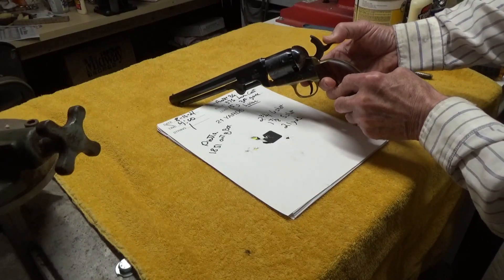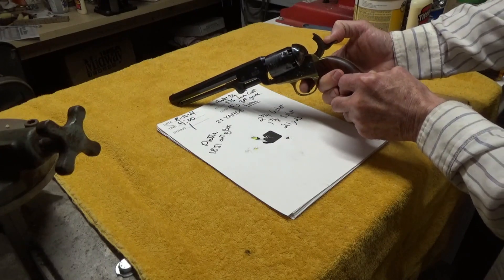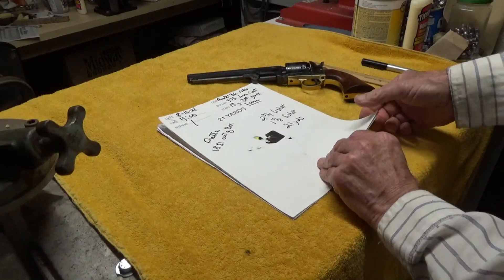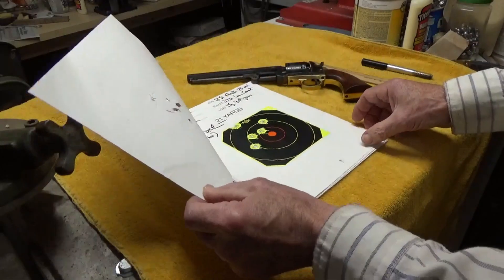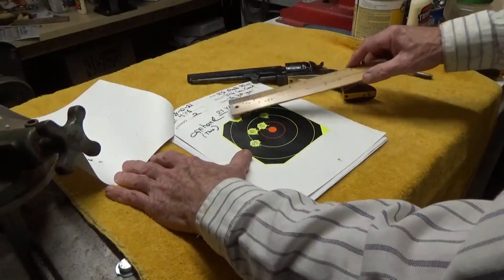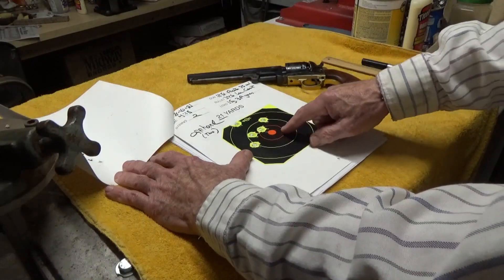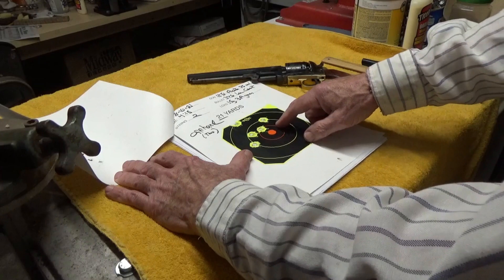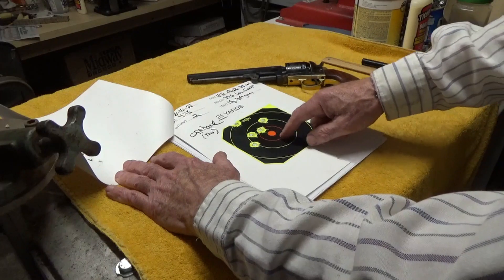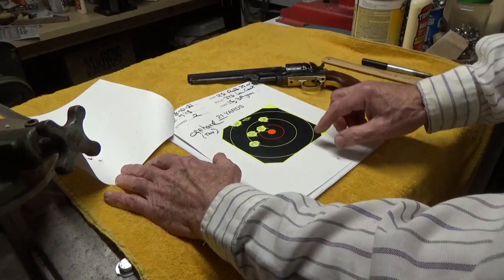The hammer lockup is way in the back — the sear is long enough in that gun to bring the hammer back — so we're not getting any real high shooting out of this gun. Inside we shot it offhand then, to see where it would hit not off the sandbags. We used a two-hand hold, and this is what we ended up with — decent enough, five shots offhand, about a 3-inch group. Still maybe a little high because I'm probably taking a 6 o'clock hold down here, so maybe it's shooting two to three inches high with offhand shooting, also taking a little more front sight with the offhand style.